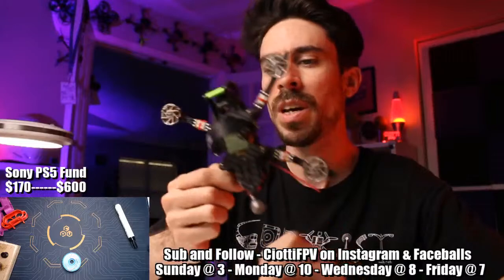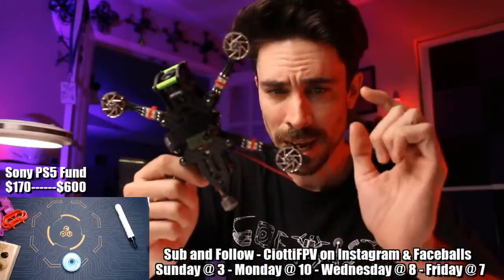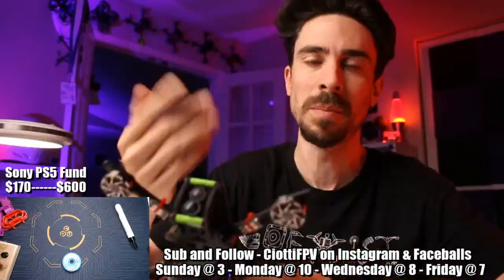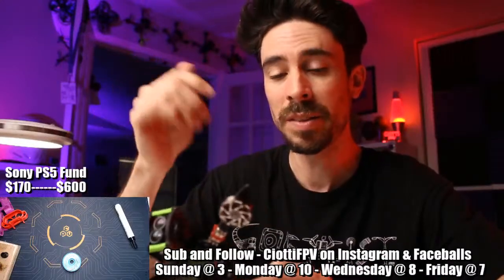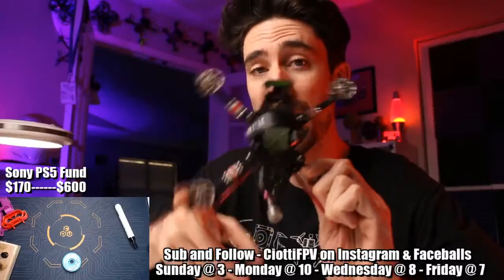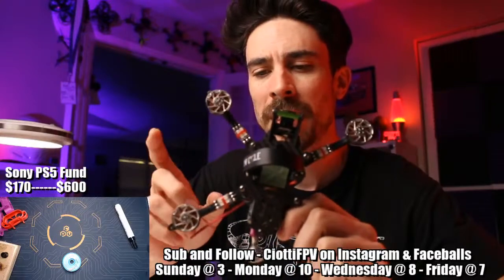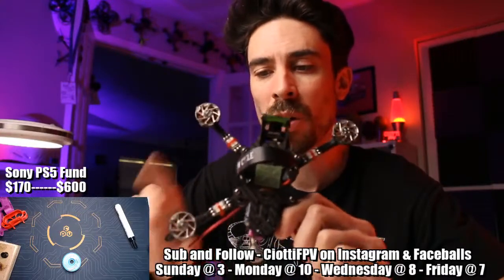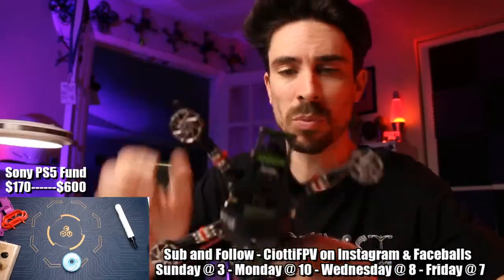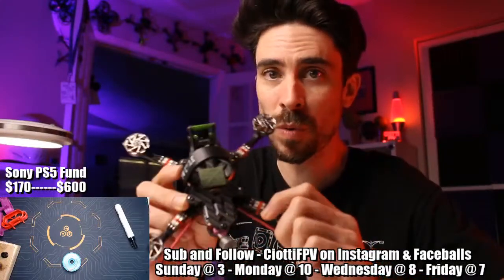But yeah, so this is the 2Fiddy with 4-inch arms, and I've got it on. So this is a very simple, very similar setup to what you were seeing in that video. Other than these are now the Aerolite 2004s. I forget which 2004s were on it there, but they were a lower KV. These Aerolite 2004s are 3,500 KV, which Tommy had made for me, us, whatever, that are on 4S. And yeah, it should rip pretty good.